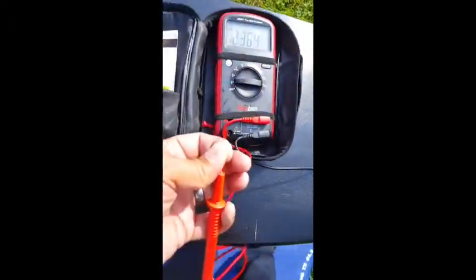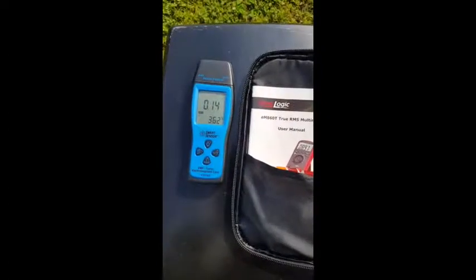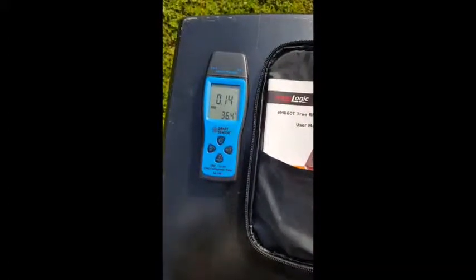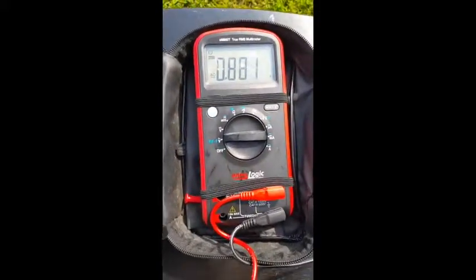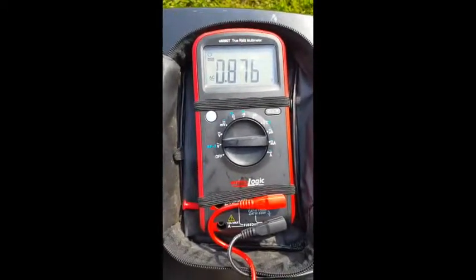With my other fingers, I pinch my thumb and index finger, and I'm also standing on an insulated surfboard or boogie board so that I'm insulated from the ground to get a true body voltage measurement. You can also see that the EMF field measured here has been up to a maximum of 0.14 microteslas. The field will fluctuate based on how much electricity is running through the power lines. With this level of field, my body is measuring about 0.875 volts AC — about 870 millivolts on average.